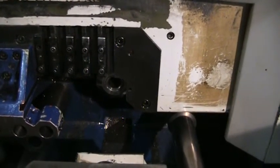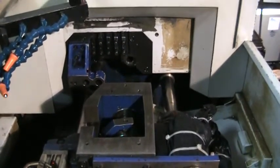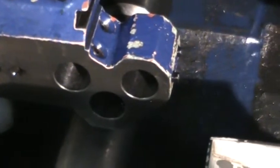We are not leveled or fully run in yet, but we could run this up to 10 or 12,000 RPM. This machine has a main spindle, 5 turning tools, 3 end working and 3 back working tools on a dog arm, and a pick-off spindle.